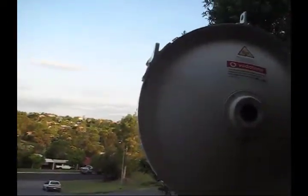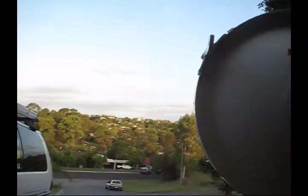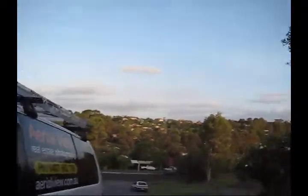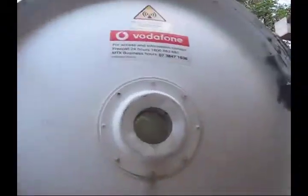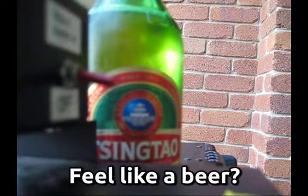Are you guys in position? Roger. There we have VK4WI and VK4FI on the hill about four or five hundred meters that way. We're just going to test the dish at 3.4. Just doing a pan and tilt to check the feed — it's really strong and it's pointing straight at them. Brilliant.